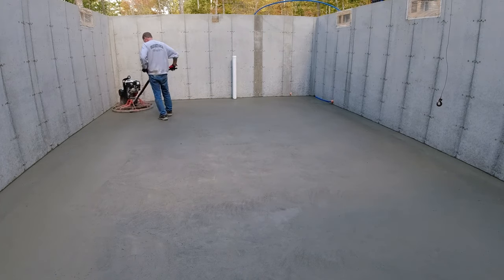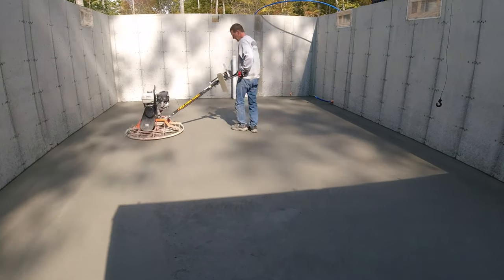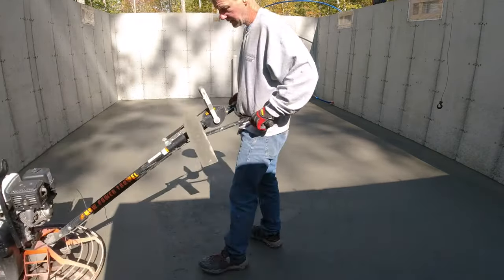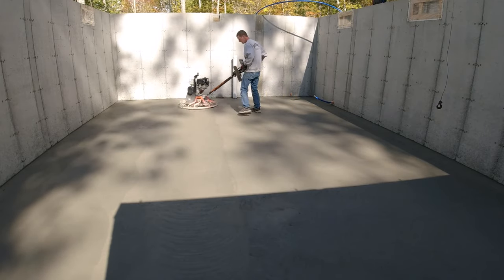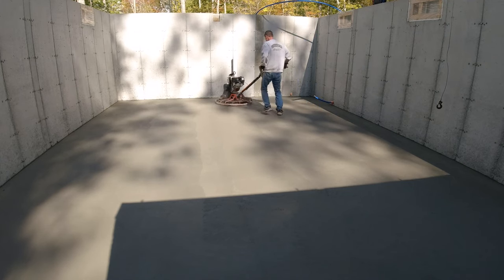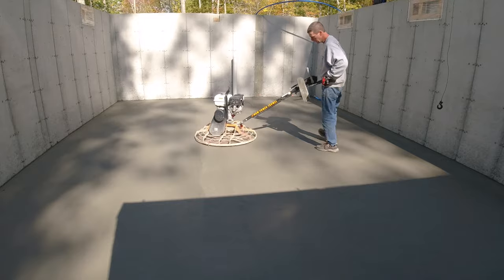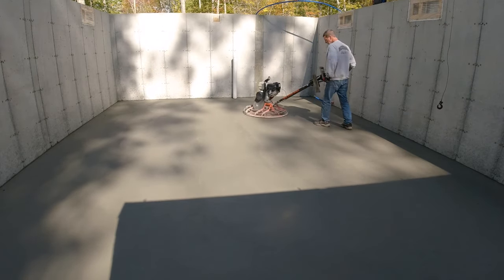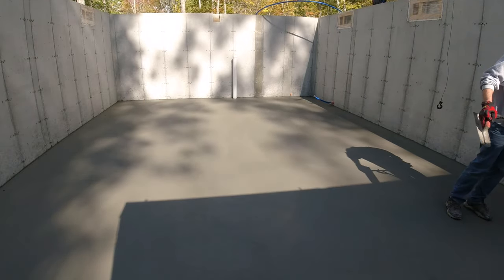The edges are getting really hard now, burning them out with my hand trowel. On the third hit I crank the blades up just a tiny bit more — it could be a sixteenth to an eighth of an inch higher than the previous time, not a lot. We always run the power trowel in a certain pattern and cross that pattern every time we hit the floor, which helps flatten the surface more. Our floors usually come out within about an eighth of an inch up and down — they're never going to be perfectly flat.